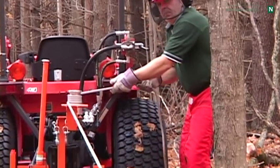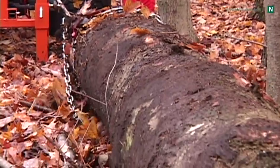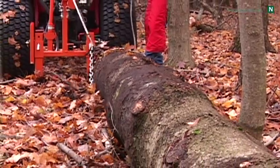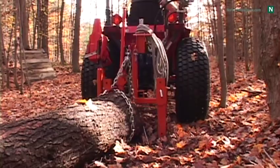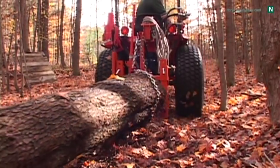The Norwood hydraulic winching skidder lets you access hard-to-get-at logs and winch them from deep in the bush right to the skidding trail. Once the logs have been winched to the trail, the logs are choked, raised off the ground, and then skidded out, turning the winch into a powerful skidder.